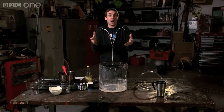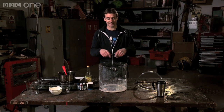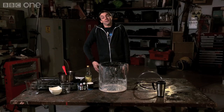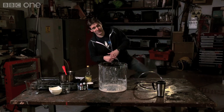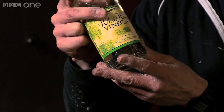Plastics are made from polymers, but not all polymers make good plastics. In potato starch there are two types of polymers: long straight ones that can all lie next to each other forming little bonds, and odd-shaped ones that get in the way of everything. So I need to get rid of the odd-shaped ones, and I get rid of them with acid — quite a light acid called vinegar.